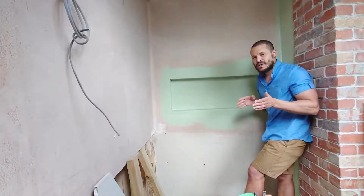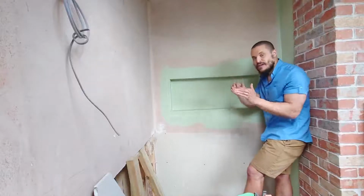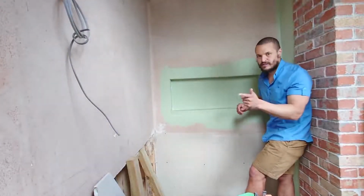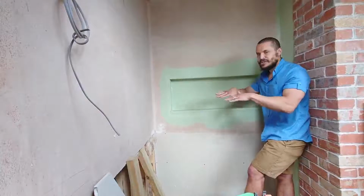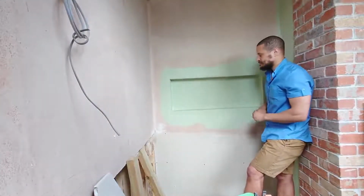Not every video you watch will actually say that, so I think that's a really important tip if you're going to do a niche. Make sure you allow for a little bit of fall, and don't rely on the tiles to give you that fall, because when the tiles fail, the grout or whatever else, then you're left with water pooling behind the tiles. So do it right at the offset, whether you're building the niche itself or you're going to be doing the structural thing like I've done here.